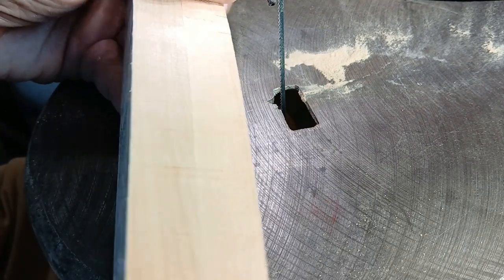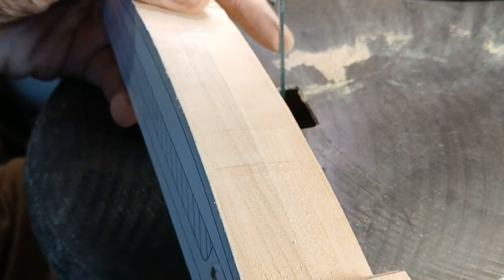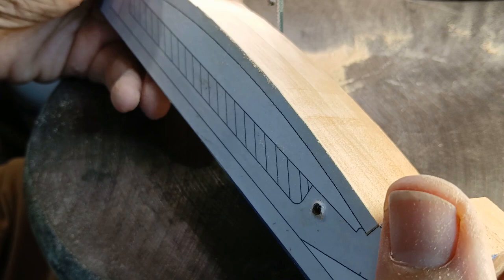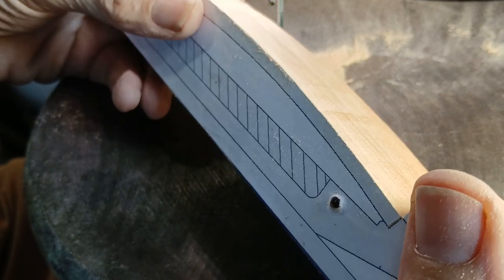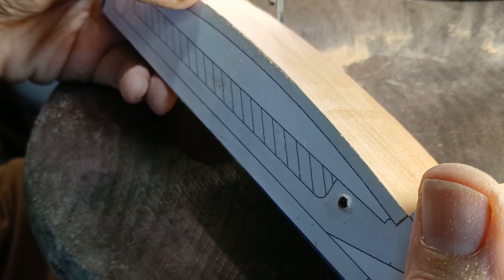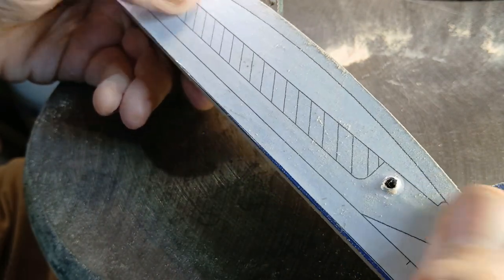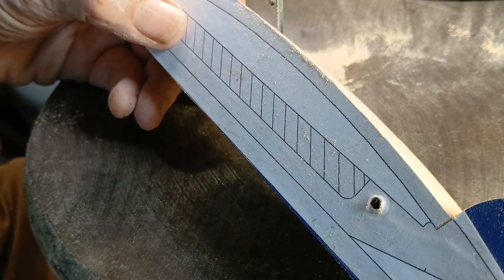So about a fourth of the way through that cut, I switched over to a pinned blade. It's the number 12, I believe. And it went a lot better. I was having a lot of trouble with that 7. It wanted to follow the grain. Didn't do anything that I can't smooth out. But this is working really nicely and makes it much easier to cut. I was really having a lot of trouble with the 7. So I'm going to go ahead and try to get this top piece cut off and see if it's going to be okay.